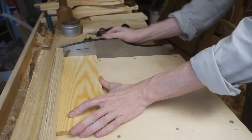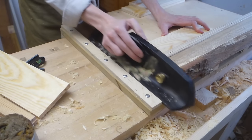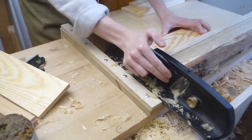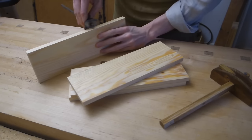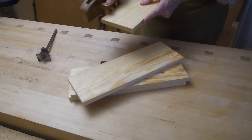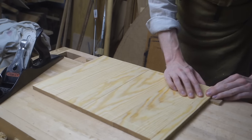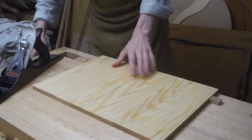The length is simply the same as the side rails with stub tenons, so no measuring needed — I could just compare them to that part. These are supposed to be raised panels, which I think is a funny term since it really consists of lowering material. I get that the end result looks like the middle of the panel is raised compared to the edges, but calling the process 'panel raising' just feels a bit humorous. That panel is just as raised as it was before — you just made the edge thinner. But anyway, that is what I did next.